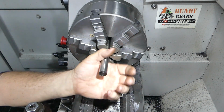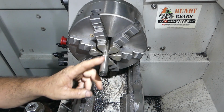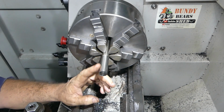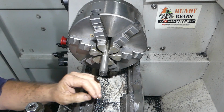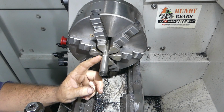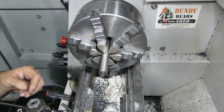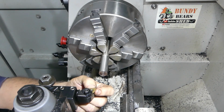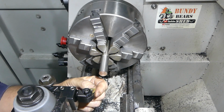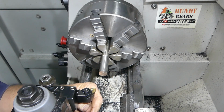Now, stainless is this stuff. It's good stuff. It's 316, it's marine grade, it's very hard, but the thing with it is, if you get it too hot, it goes bloody hard, and I'm not sure my little lathe would handle it. So I'm going to have a go at making one on here. I've got carbide tooling. Now, I've got to drill a half inch hole up the middle there. I've got cobalt drills, so I don't know, I'm just going to see how we go, eh?